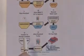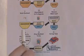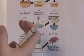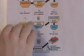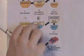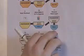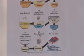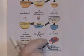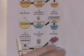What's going on chemically is methanol and lye like water more than they like oil. So those chemicals are going to attach to the water. The water is going to pull out those impurities, and what we're going to be left with is finished biodiesel that's nice and cleansed. We're then going to pull the water off, because water and oil don't like each other, and transfer it into another container, and then we're going to allow it to dry. So those of you that were wondering if we're going to put water in the diesel, no, we're not.